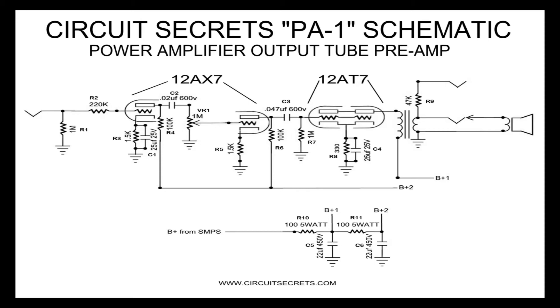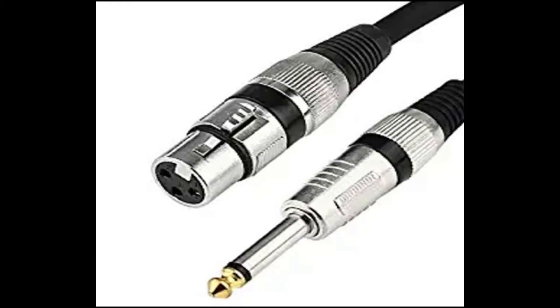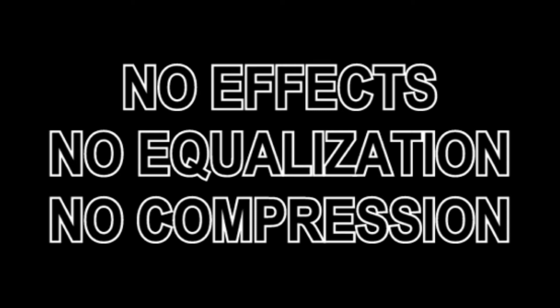If you're wondering what it sounds like, I'm using it right now. My recording rig consists of a Neewer condenser mic package which contains a mic, windscreen, shock mount, and phantom power supply — the entire kit costs less than most average quality mics. This is connected to the preamp with a balanced to unbalanced cable, no matching transformer, and it is recorded at 16/96 with the line in on my sound card. The video production process drops the sampling rate to 48000. The computer I make videos with has no special recording interface, and I am not using any effects or doing any post processing. In fact I never even use a compressor.